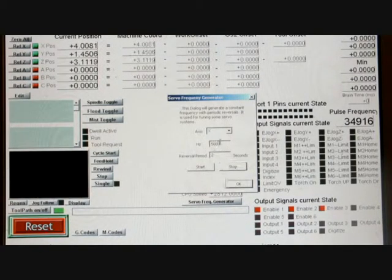If we stop that and increase to say 1,000 Hz — that's 1,000 steps per second running for two seconds — the head will move a total of 2,000 steps to the left and then 2,000 steps to the right. You can hear a different pitch to the motor; it's not very happy. On earlier tests I noticed that at the slower speed it did vibrate a little bit, but I haven't altered any settings because I wanted to leave them the same as for the CNC milling machine. Let's change that to 2,000 steps and see what happens.